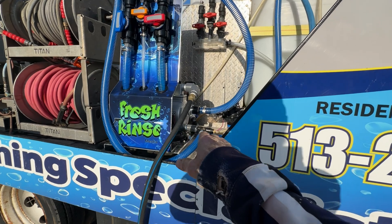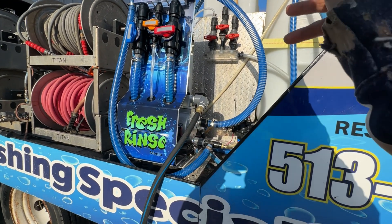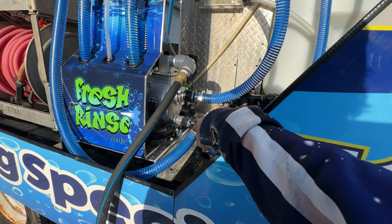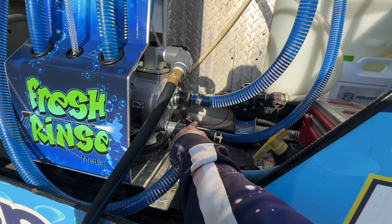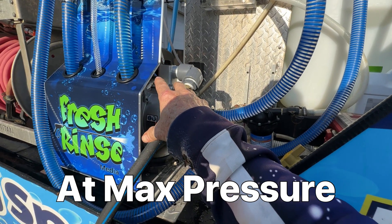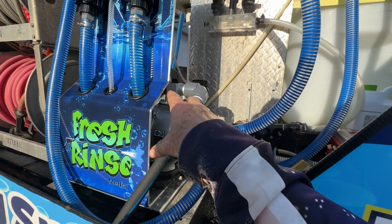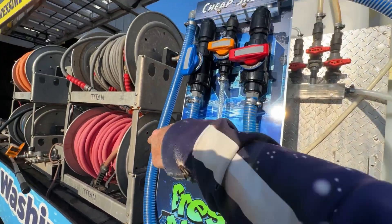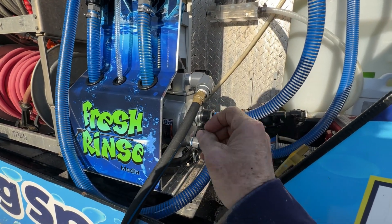Let's talk about what some would call bypass — it's not a bypass. It does not bypass water back into the tank. What it does is act as a pressure relief valve setup. This banjo pressure relief valve right here has been set so that when the pump gets under pressure while off the trigger, it will then disperse whatever fluids are running through the system through this loop and then back up into the system. So it doesn't bypass — it just releases pressure.